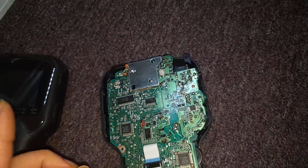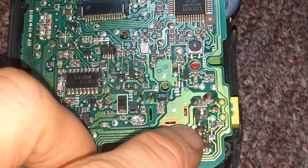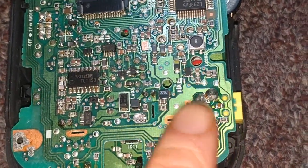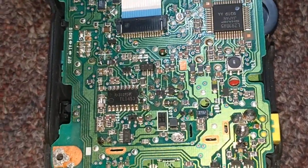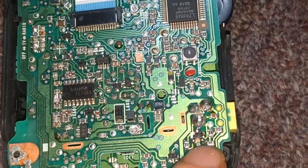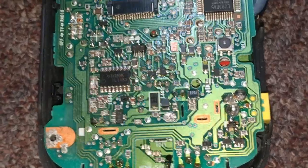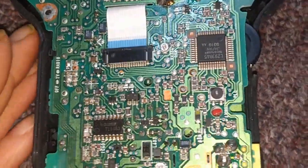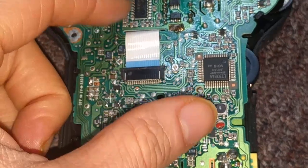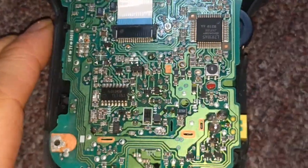The things that were wrong with it — a couple things. One is there is a 100 milliamp current capacity PNP transistor for the input voltage, and I highly recommend not using the power supply that this comes with. It's really one of those bad unregulated types — class 1 transformer types. Use a proper class 2 switching power supply and it'll be a lot happier. I had to replace that. But I also had a bent trace on the ribbon connector for the screen — it actually has another FPC plug on the other side, and I ended up swapping it around.